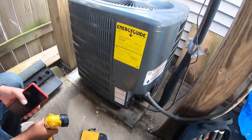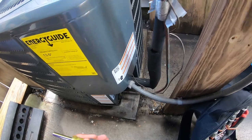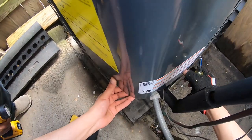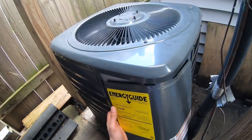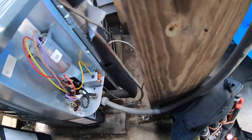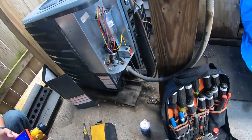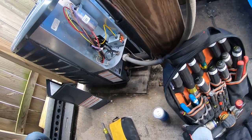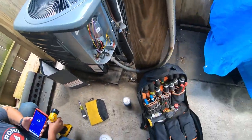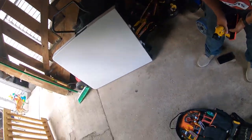We'll check, guys. Yeah, so we're outside now. But this one has 2 screws, man. This guy. And this guy. Or it could be a few things. A bulb? What's going on? You know where the circuit panel is for this? It's the only 220 you got. I want to check to see if the wires are straight or they're cut somewhere along the way. Because for right now, I believe it's not receiving signal from the thermostat wire to outside.